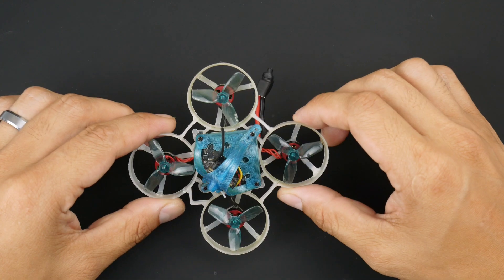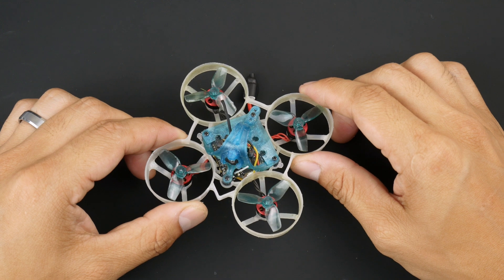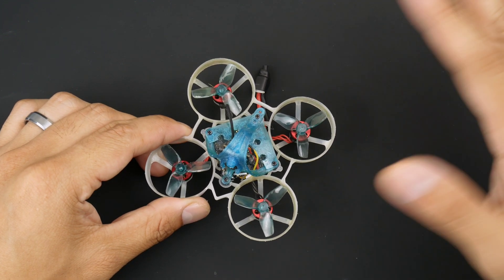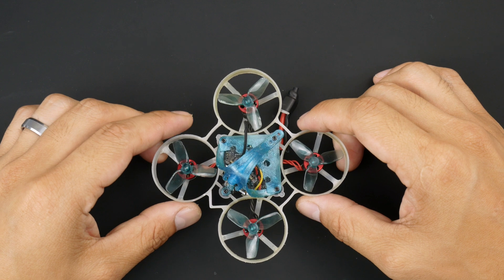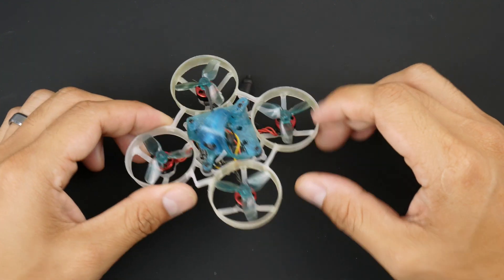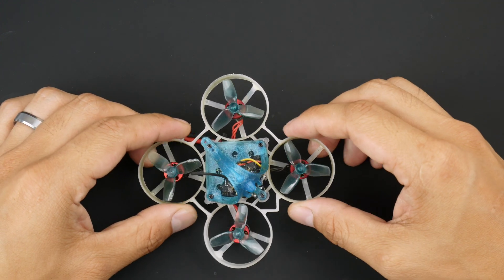The camera hasn't died yet. But one thing that has started to die — and why I'm making this video — is the VTX. The VTX has started to die. I get black flashes and very bad range and signal. I can't even fly further than about 30 meters without it going really bad and not being able to see anything. I've tried everything including changing the antenna, and it doesn't seem to work.